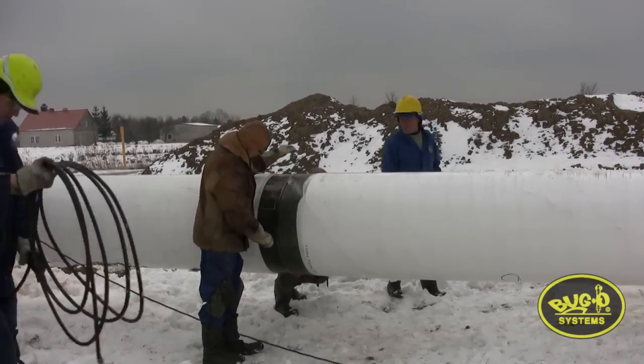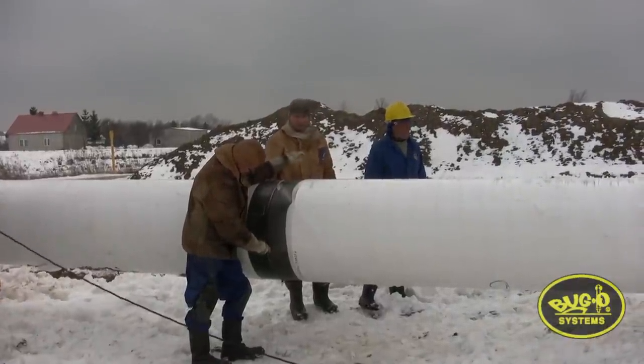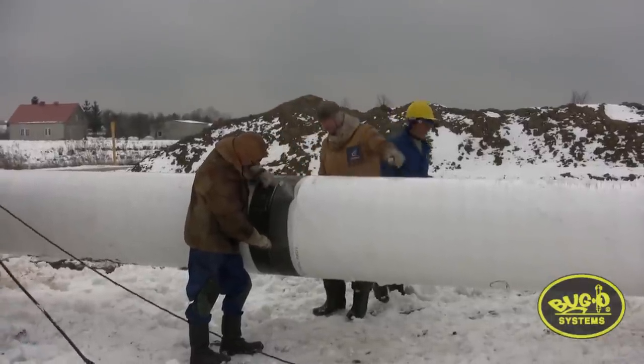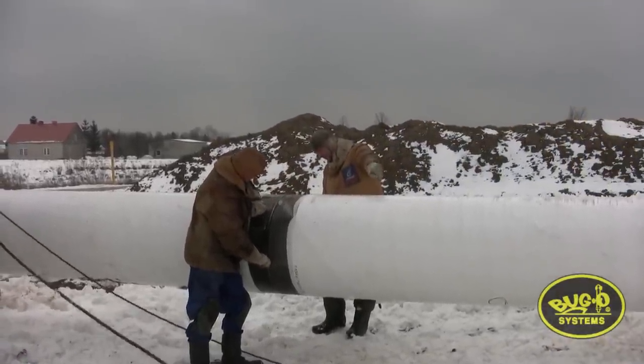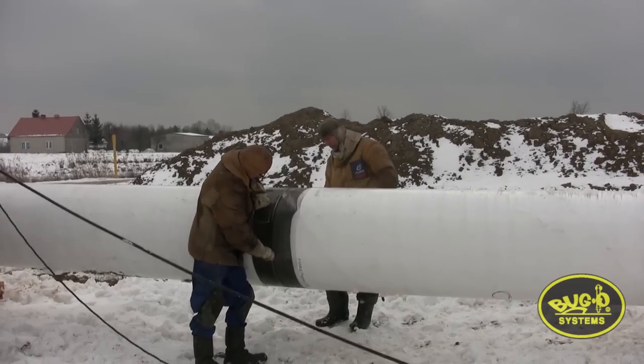The root pass welders now instruct the side boom operator in order to adjust the root opening gap. Very small adjustments are made. The welder on the near side is placing a gapping gauge into the root opening. Once he is satisfied with the opening, he holds his gauge in position while the welder on the opposite side directs the boom operator.